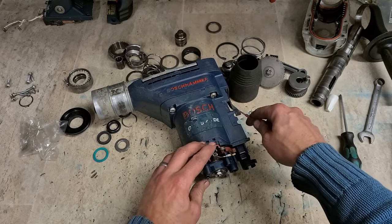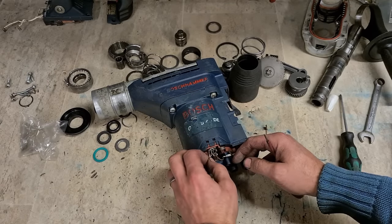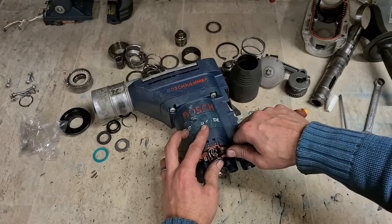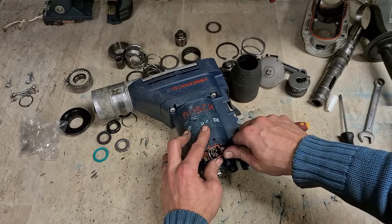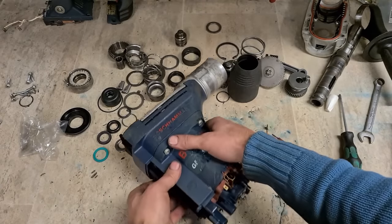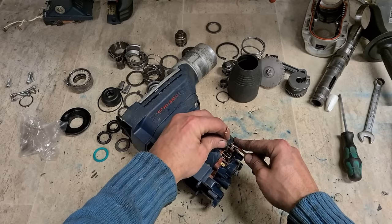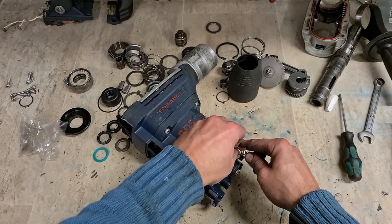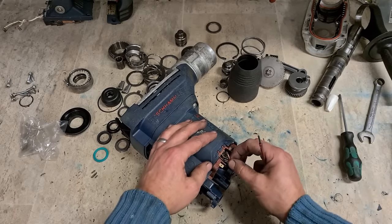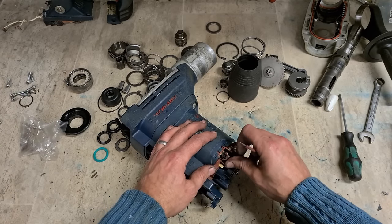Switches on a light up here, the service light, whenever the brush is run down too far. It's not doing anything else. So only just relaying a wee signal. And these also have a little spring and pin bolted onto them as well. So even if you ignore the light, they'll pop and stop the machine anyway, once they wear down so far.